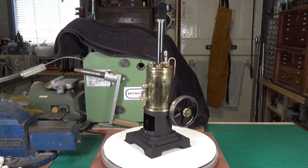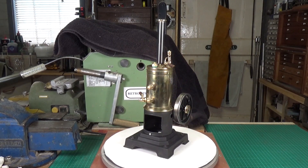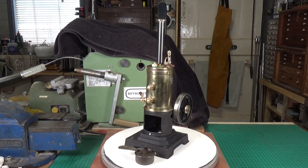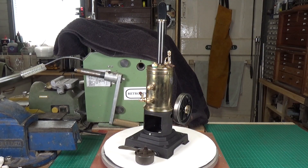It's really just the sight glass issue at the moment. I can't really see a way of using the glass I've got and sealing it, so what I may well do is simply block off the holes for the sight glass — that's fairly easy — which will at least allow us to steam it. I've got a little burner out of one of my Bing engines which I think will do the trick nicely. I'm impatient to see this running on steam, so that's probably what we'll do.